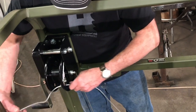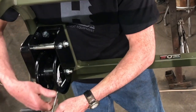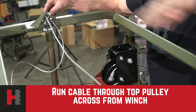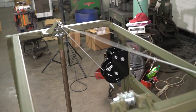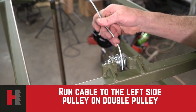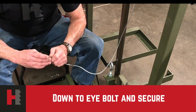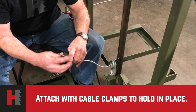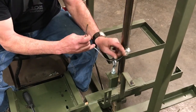After the cable is secured, we're putting the cable through the winch itself to the inside. We will be rolling the cable over the top pulley itself, running it through to the other side, and running it over the right side roller. This is very important — the cable must go in correctly. As you see where I'm pointing, that will be the roller where the cable will be. The cable itself will be slid through the eye bolt, and your two fasteners will be above the eye bolt itself, securing the cable in place.